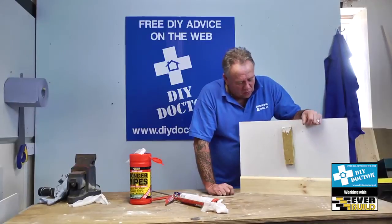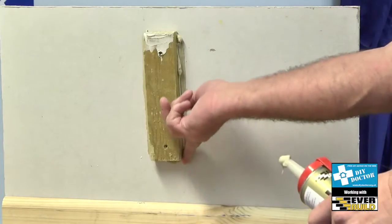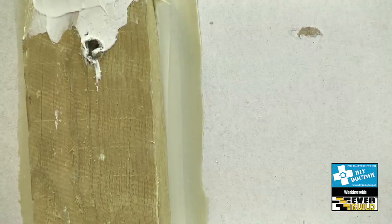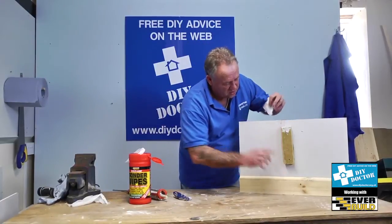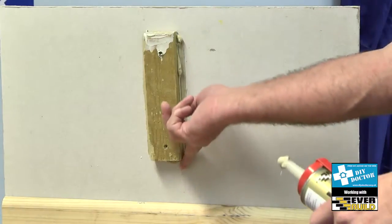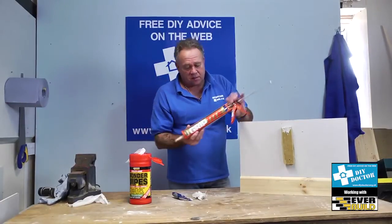Having put that batten on the wall, which is ideal for dry lining or whatever other purpose you want to use, we're then able, if we need to, to use the Everbuild GripTight to run up the side as well and fill that gap. You'll see a lot of pros running their finger down that gap. Assuming this is going to be used for dry lining, this joint isn't going to be seen so I'm not going to use the Everbuild Sealant Tool to make that a neat joint. You can see how flexible that was and how easily it went into place, so we've got a really solid fixing both on the side and of course behind. That's Everbuild GripTight, recommended by DIY Doctor.